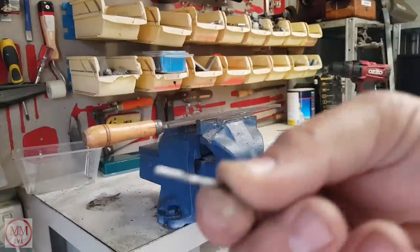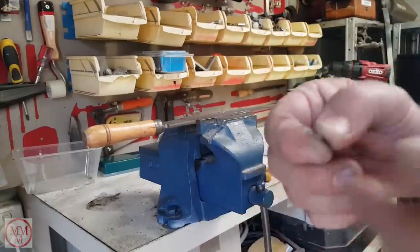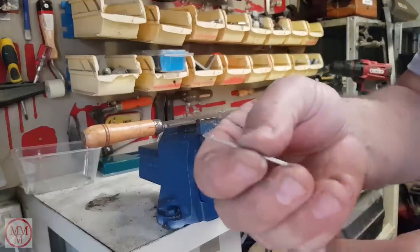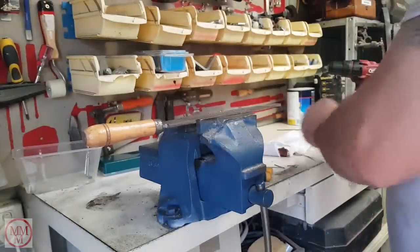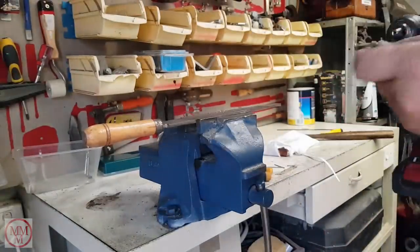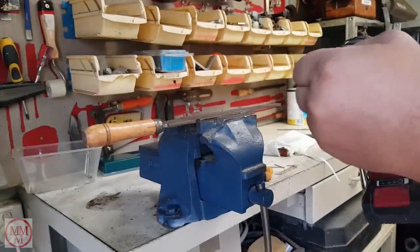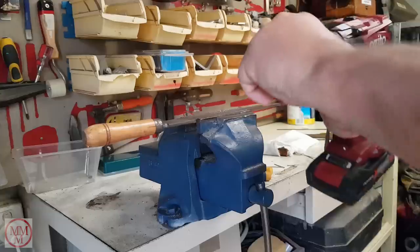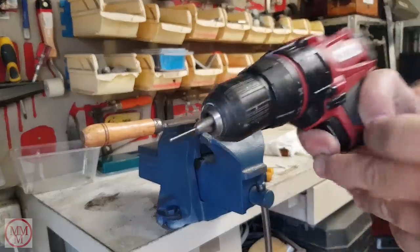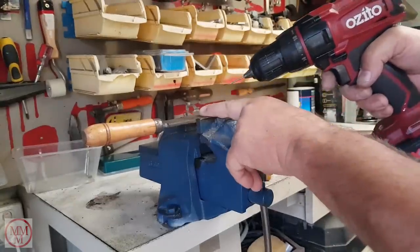Right, I'm back in the shed, and here's one of the axles that I had to wear down. It's a little bit too short to reform, so I'm going to make a fresh axle out of a nail. So using my battery drill and a file in the vise, I modify the profile of the head of the nail to resemble a hubcap on the end of the axle.